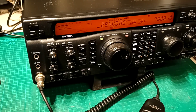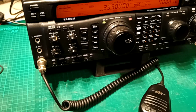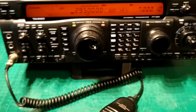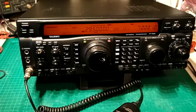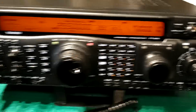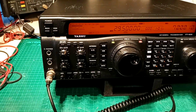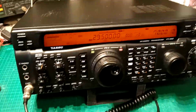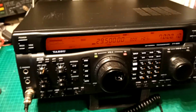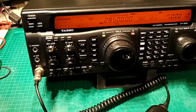I've repaired the FM issue and it turns out your problem with the power was actually the negative fuse holder. We're getting a negative through the radio — the positive was obviously connected, but the negative fuse holder, which is currently sitting there, needed to be cleaned up. So I cleaned it up, put it all back together and sure enough, power's back up. The FM board had a fault, so I've repaired that FM board, and the little microphone input switch wasn't operating, so I've repaired that too.